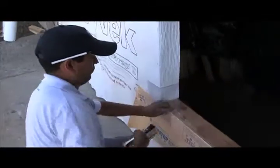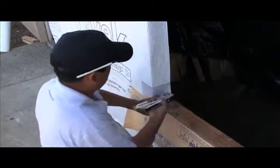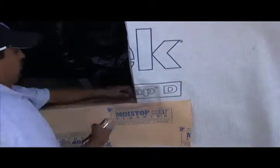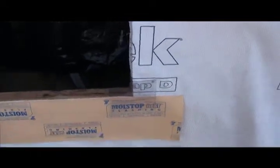Notice we're not using a hammer tacker. Ask yourself why wouldn't we be using a hammer tacker right here? The answer is Percy is able to precisely position those staples. When you use a staple gun, the positioning of your staples is extremely precise and we like that. A guy who's done this a bunch can do this very quickly — we're slowing it down so you can learn from this. Anyway, our flashing corners are in and the bib is on.